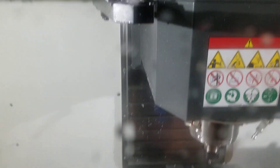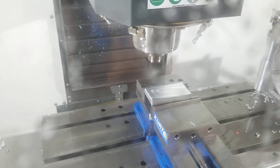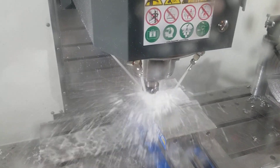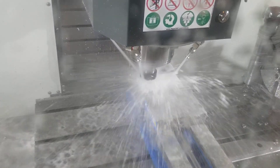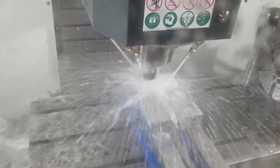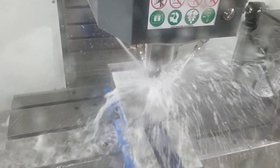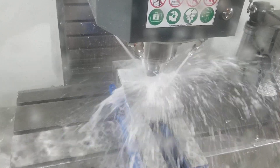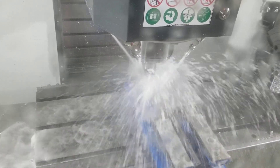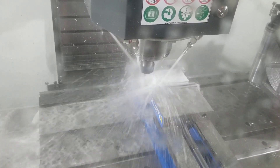Our position distance-to-go is looking good. This tool path is going to go in, add a little corner break on those slots, and then do the periphery. We're doing a heavier corner break on the edge here, so it's taking an initial cut and then going around again to do a cleanup cut.